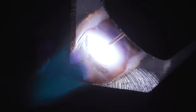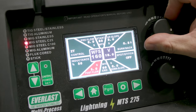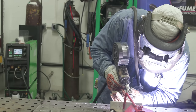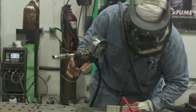Another common question we get all the time is: I'm getting fish eyes at the end of my craters. One thing you can do if you have the advantage of having a post flow on your push-pull gun or your spool gun, use about four to five seconds of post flow. If you don't have that option, you can go off half cocked — what I mean is, if you pull the trigger all the way down, you're getting shielding gas and wire. If you only pull the trigger about halfway, you're just getting the shielding gas. So once you terminate that weld, allow it to fill in for just a split second longer, then back off on the trigger — you still get shielding gas. Hold it there for a few seconds and let it solidify under that argon-enriched environment before you pull away from the weld.